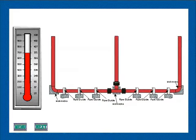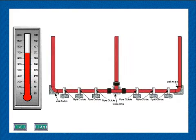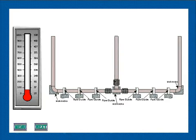This animation typifies good practice in the use of expansion joints to absorb axial pipeline expansion in a pipeline with a branch connection. The anchor at the junction, which in this case is a T, is the main anchor designed to absorb the thrust from the expansion joint in the branch line. Note, as in the previous animations, the closeness of the pipe guides.